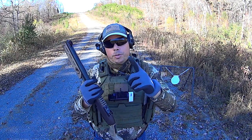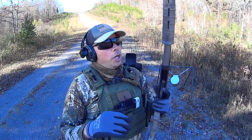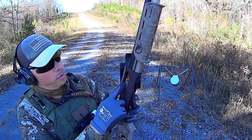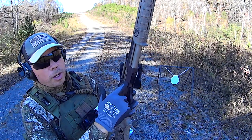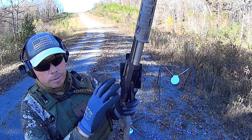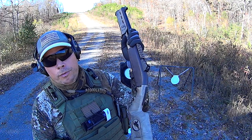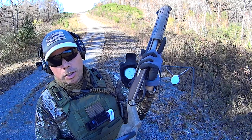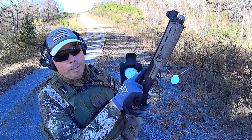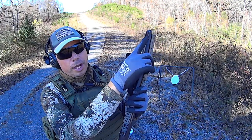There was a lot of bouncing of components around the country, but we finally got it legally done. What's interesting about this shotgun is that the entire thing is nickel boron coated — all the internals, the inside of the receiver, everything. The mag tube is also part of the receiver, so I masked off the tube. You're looking at Rust-Oleum flat camo paint on the receiver — just a dark brown. The only thing that isn't nickel boron is the barrel, which has a black ceramic coating done by Hillbilly 223. Nighthawk Custom did the rear sight, the pic rail, and the front sight fiber optic.